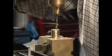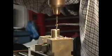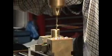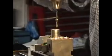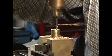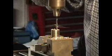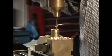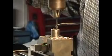This is an undersized eighth-inch hole by several thou, and then I'm going to ream it out one thou undersized to 0.124". The last hole was drilled on the lathe, but this one, since the mill will position it exactly a quarter of an inch away from the previous hole, it's easier to do it here.